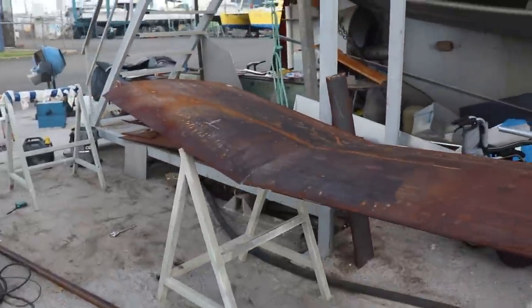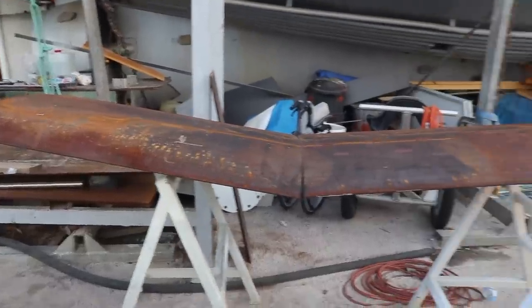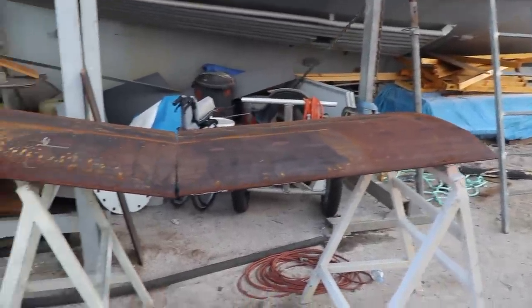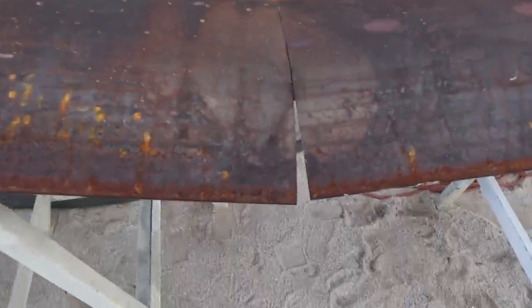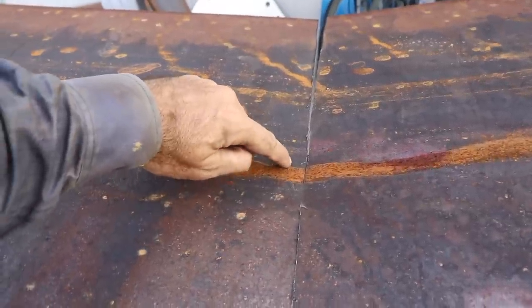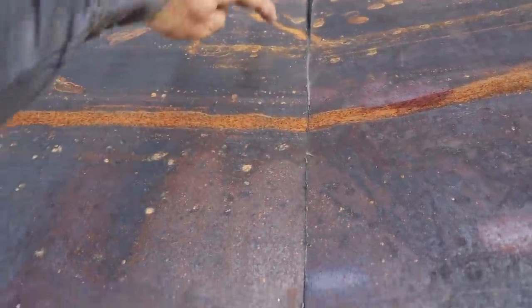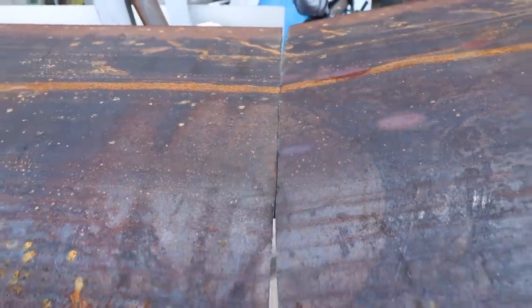First look, this is our wings. So you can see the bend that we've been trying to go for all day. That end there is the hinge end, and the join, obviously there's a little gap in there at the moment, but what we need to do is actually file that out. So we're just going to take it out of one side because it's not a big join to deal with, so probably taking maybe 20mm out of one side, do a gentle slice, and we'll be able to close that up, run a bead over that.